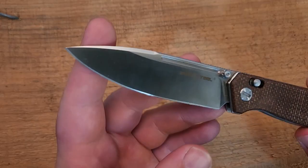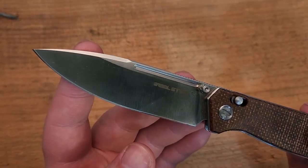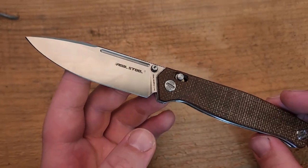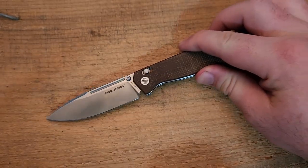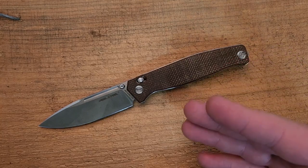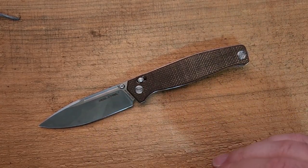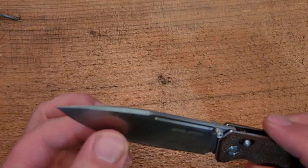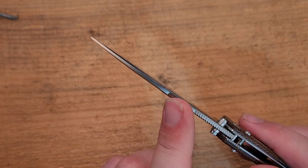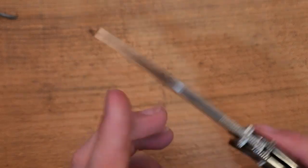Let's take a quick look at this very nicely done satin blade in VG10 steel — really nice performance, very stainless, decent edge retention. VG10 is a great steel, and at this price point — around 80 bucks — that's really nice to see. We've got a nice little swedge up top, very thin behind the edge, so this is going to be a pretty slicey knife. The blade stock is about an eighth of an inch thick: not a big hefty blade, but thick enough to be robust while allowing for that slicey edge.